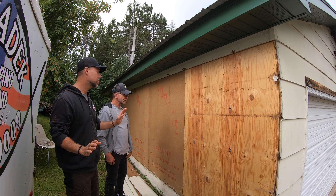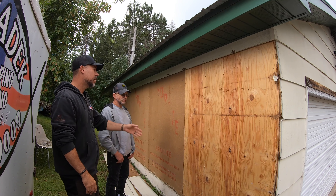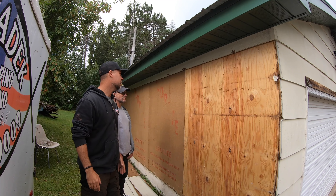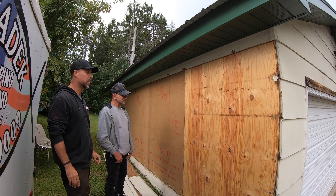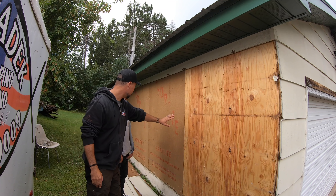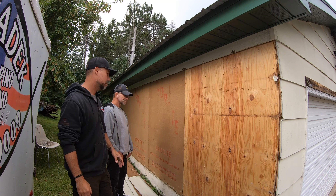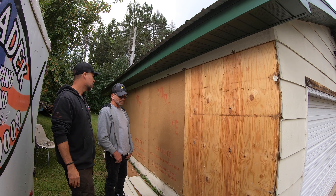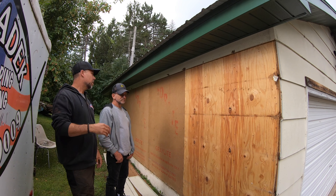When you pull your siding off you may find Built Right felt board on your buildings — don't panic. You don't have to go out and replace all of it with plywood. There's a reason you can use it. I don't personally like it and wouldn't put it up myself, so if we were redoing it or if any of these sheets weren't in good shape, it would be plywood — we'd never touch this stuff.